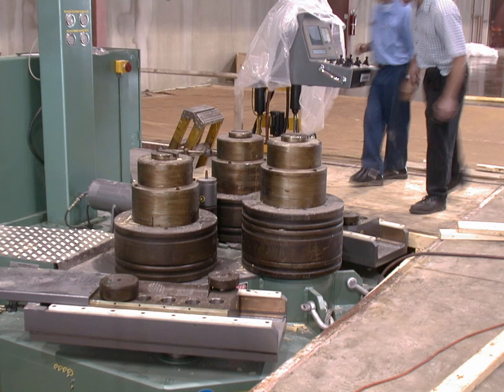This shows a set of rollers that do the forming. There is a mechanism for adjusting the spacing of the rollers to accommodate different sized elements and different amounts of curvature. The shafts and bearings for the rollers are almost the full diameter of the rollers, and they must be very large and of very high strength material to resist the huge forces required to deform the heavy structural elements being rolled into a curved form.